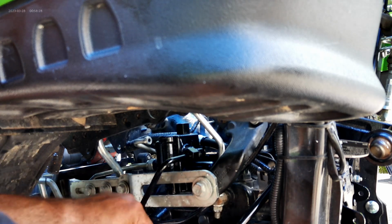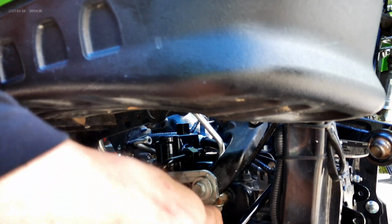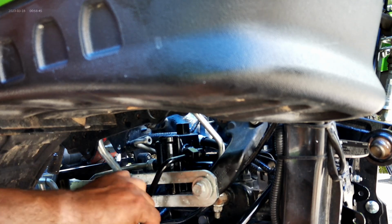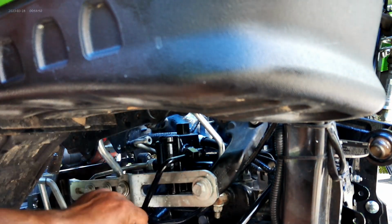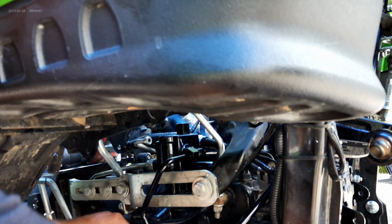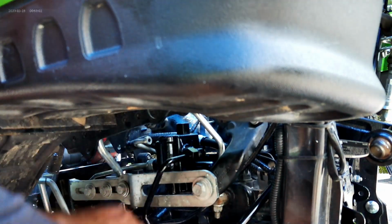And then you're going to start. Once it gets started and you go a little bit, you're going to back up a little bit, break the burrs off, then go back in again. Back up a little, break the burrs off, go a little more. Back up. You'll feel it start to get tight. When it does, back it up a little and break off the burrs.